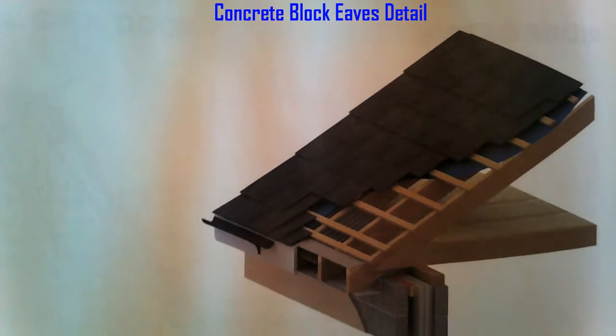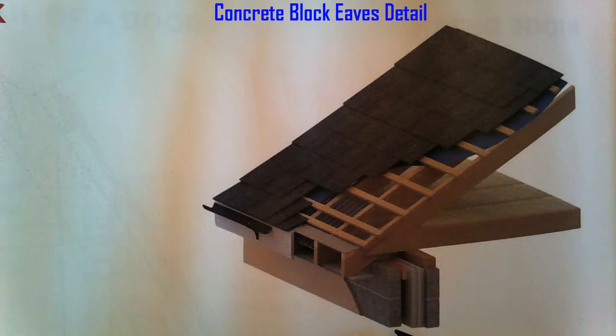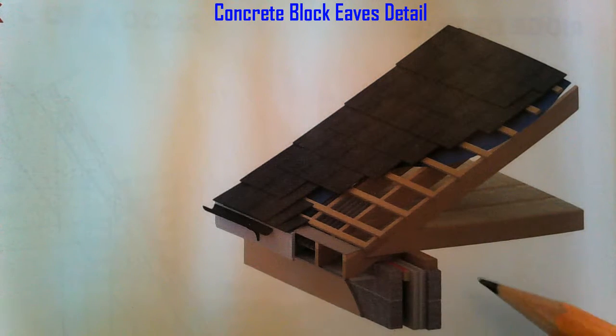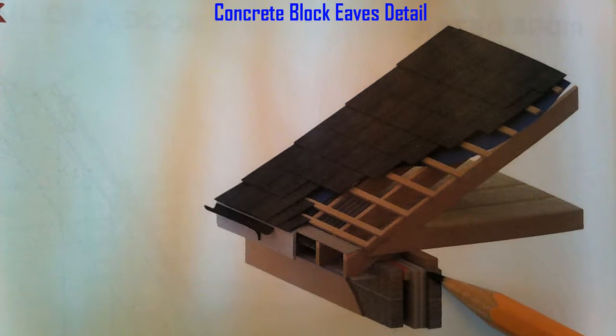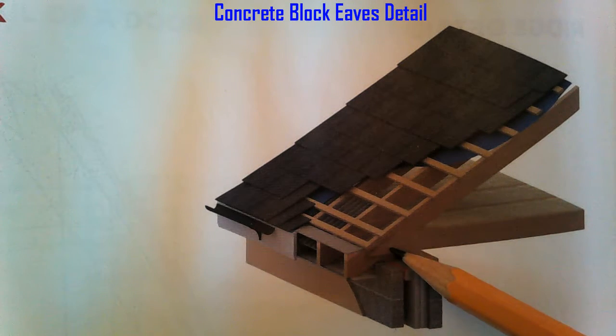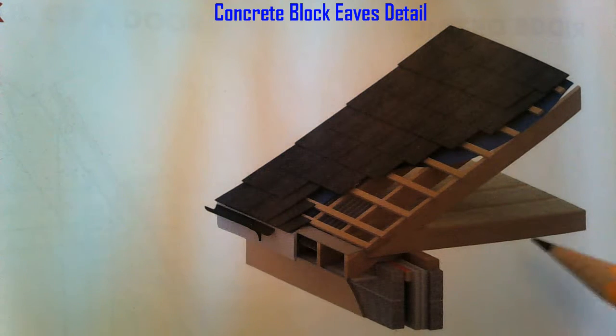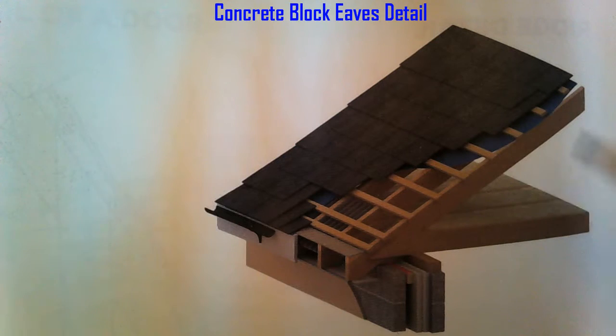So there are these details for a concrete block wall: 350mm wall, 100mm outer leaf, 150mm cavity, 100mm inner leaf. There's 100mm rigid insulation sitting on the inner leaf. With new regulations there's no cavity closer block anymore. The wall plate is sitting on the inner leaf — that's the thing that carries your joists and your rafters. In between our joists we have some rockwool insulation.